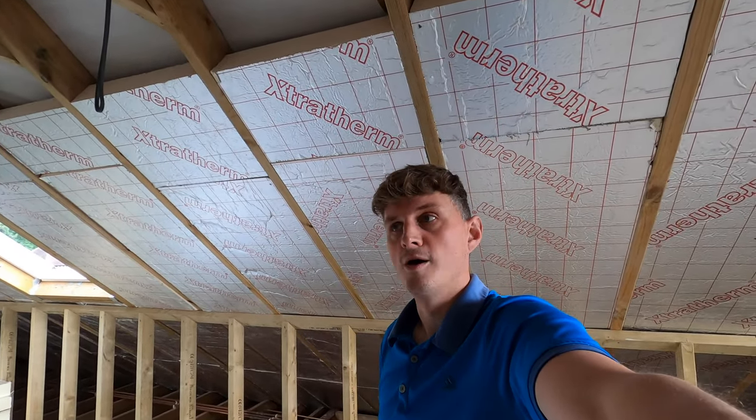And then down here is my last phase. So this is the plasterboarding. It's really slow because obviously at this angle, it's really tough, definitely need two of you. And I'm here alone today, so I won't be doing any more of this until I get some help. You probably saw we threw some more of this wall insulation in the ceiling first to fill any gaps, and then we boarded from the ceiling all the way down. And in the meantime, I've also been insulating everywhere. So I've been putting 200mm along the floor in there, and along the floor all down the sides.